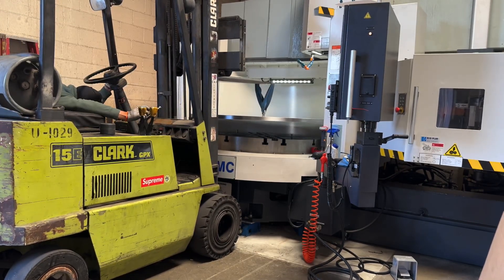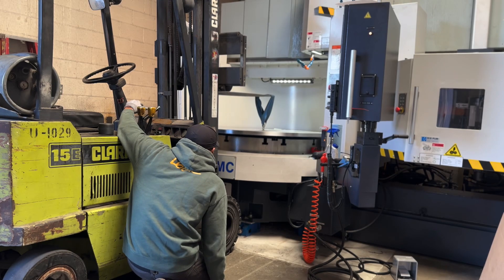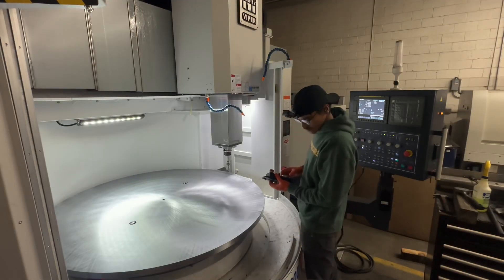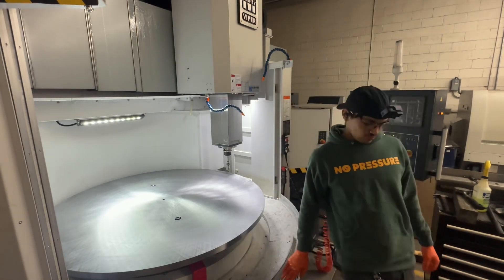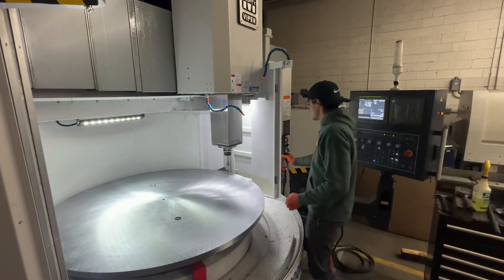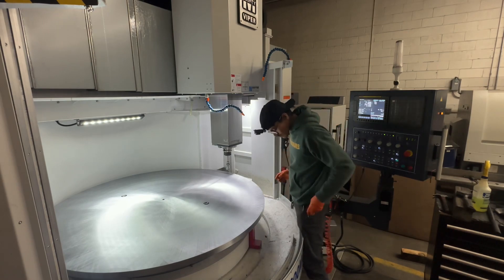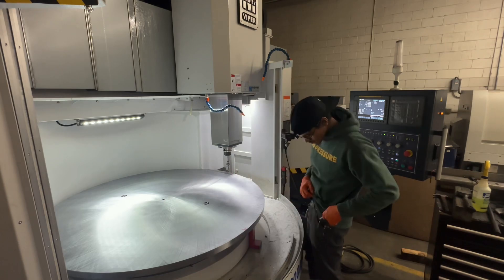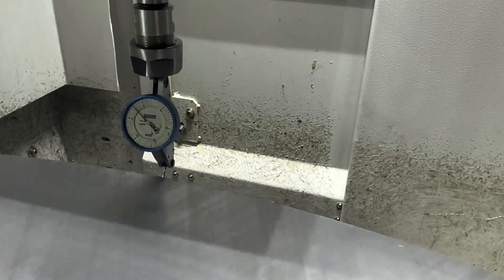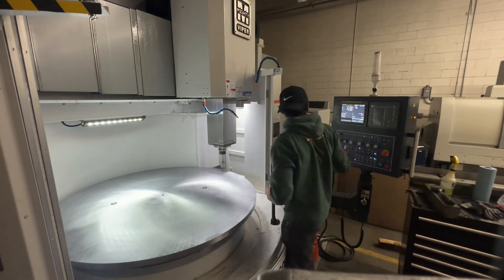Here I'm just aligning those two holes to the screw. I set the bolts in a rough position that we got drawn out in the computer. I'm pretty happy I got that within 15 minutes of lining it up. Just going to do a rough indication using a piece of wood and a hammer — don't want to strike the hammer directly onto the plate. I'm going to take my time and get it as close as I can. Since we're turning it, I got it pretty close, within about three, three and a half thou. Just going to tighten those two bolts down.